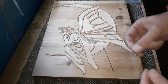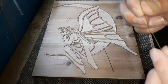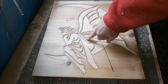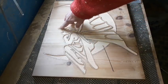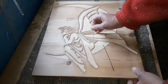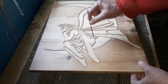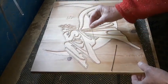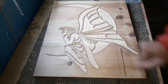Your second blade is what they call a pinless blade, self-explanatory. There's obviously no pins on the end of that one. These are really fine. These are ideal if you're doing a lot of intricate inside work. Say you're taking this middle section out, which we're going to do in a minute, and it was really small, like something into the earpiece, you would drill a pilot hole. As you can see, I've drilled three holes in there already, and you would feed that blade through. Now, it wouldn't matter today because it's quite a big area, so you could drill a bigger hole and feed that pin blade through. Like I say, if it was really small or really detailed, you'll get that pinless blade in a lot easier and not need to drill such a big hole.